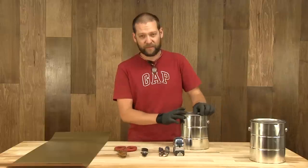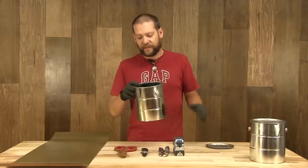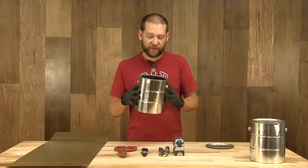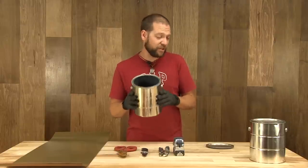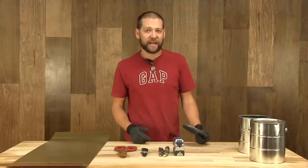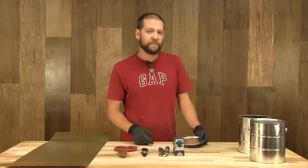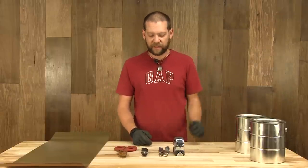You obviously want to pay attention to what's been in your cans. If you have to burn a little paint off — and this is manufactured paint — that's something you're going to have to make sure you do outside with plenty of ventilation. With food grade cans, they're all lined with plastic and plastic will burn off too, so that's going to be a little toxic also. Just be aware of these things. Once it's burned off, it's safe.